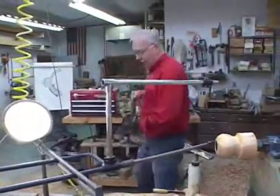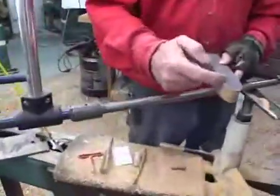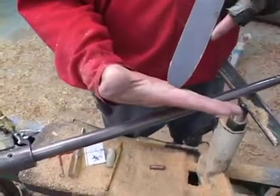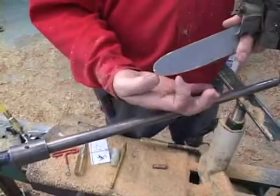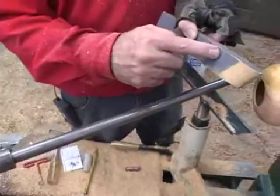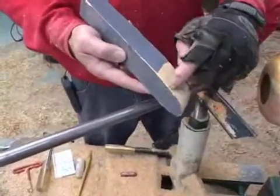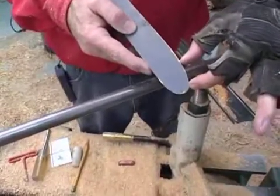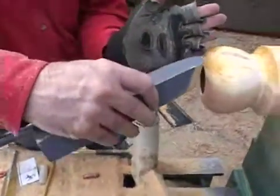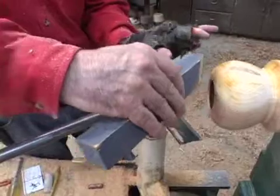One of the things that I do with the cutter, this is a mock-up of one of the cutters, I never have the cutter facing right towards the sidewall of the vessel. I always use the radius around the side, and if you can see how it's sharpened around the side, it's not sharpened on this side because we don't go to the right, but we always go to the left, and so it's sharpened back here. That radius, that broad brush of a radius, is the same kind of a radius that a teardrop scraper would have. So now I have the swivel assembly so that I can use that to clean up my tool marks, and then I have got a broad brush to do it nice and clean.